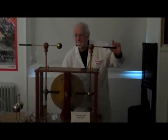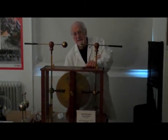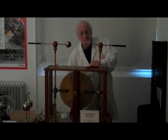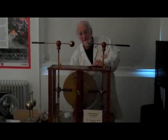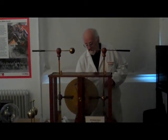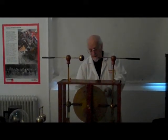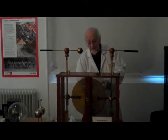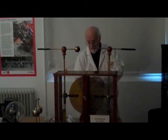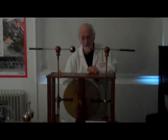On a good day — slightly damp this morning — but on a good day we can get a 5-inch spark on this machine. A 5-inch spark is probably around about 150,000 to 160,000 volts. If we wanted to increase the spark length and increase the voltage, we would have to make the discs larger. The voltage is really a function of the diameter of the discs. This is about the maximum you can do with a 12-inch disc, but as I say, it's a very, very good machine indeed.